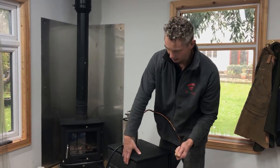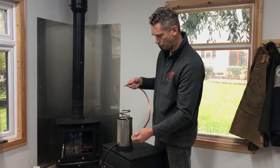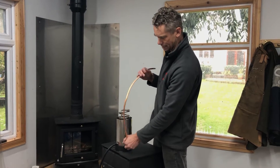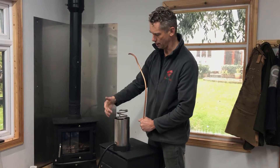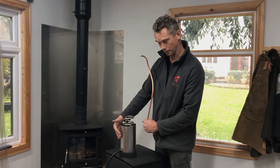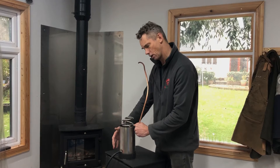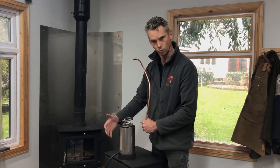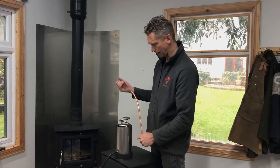So if you're coming in contact with it, or can't get clear of the stove, you need to use it. If you're coming straight up above the stove so it can't get out of the direct heat, people put their pump into the loft and run the line up into a false flue — it'll be close to the single skin so it'll be kept hot there, and particularly it's directly in the radiant rising heat of the stove so it can't cool down. It won't melt it, but it will dry out, so you use copper for that.